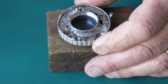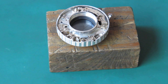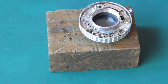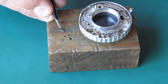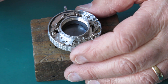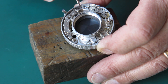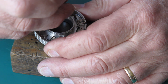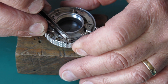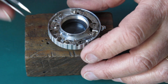That all looks good. Now there's a spring that needs to be hooked on here, and it's sometimes a bit entertaining getting this into place because it's under a bit of tension. You need a decent, fairly stiff pair of tweezers. I've got to connect the loose end of the spring to the hole in this arm, and the last coil of the spring goes over this tab here like that. So that mechanism's all in the cocked position — it's armed and ready to release.